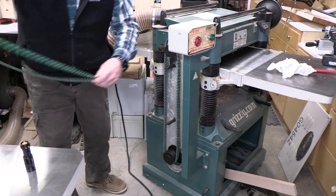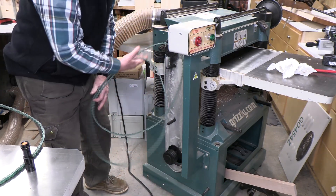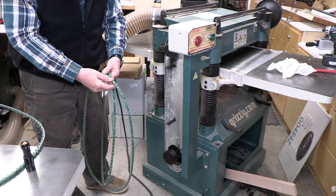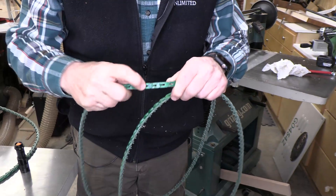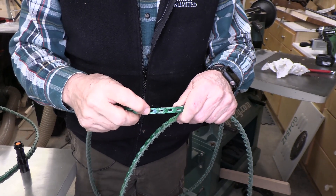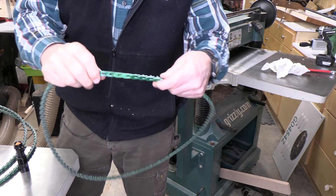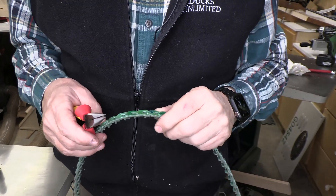I've made a mark showing rotation direction on one belt, and I'm going to make a mark on all the other ones in the same direction. There is one direction that is the smoothest running for these link belts, and we're going to put them on in that direction — they're also good for reversing motors, but smoothest running matters here.